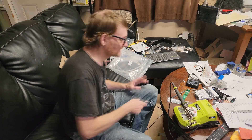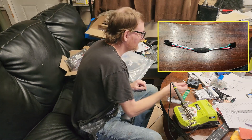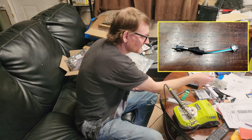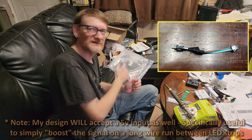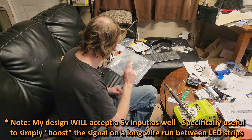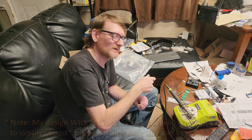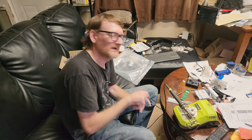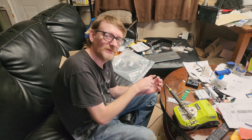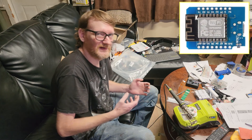So I've got a long day ahead of me assembling various versions. I want to make the Pi version specifically for Hyperion-type projects. Then there's the inline version — basically just a male and female LED connector that you can put in line with any LED strip. And then I want one more version where one side only has a data and a ground — just the white and the green — for any other projects. You can plug it into your breadboard, ESP32, ESP-01, or ESP8266.